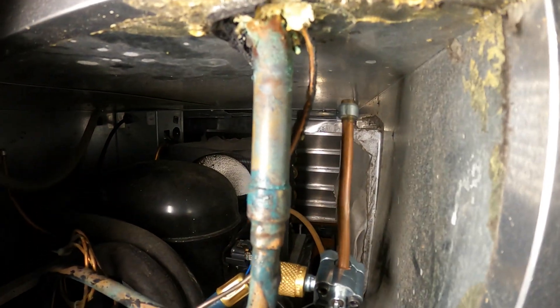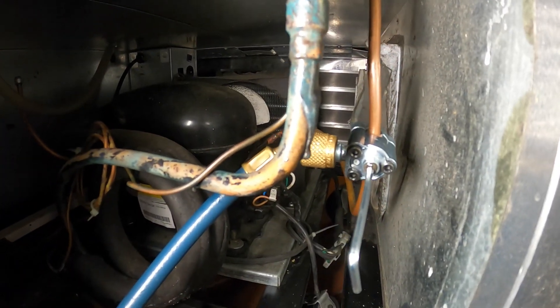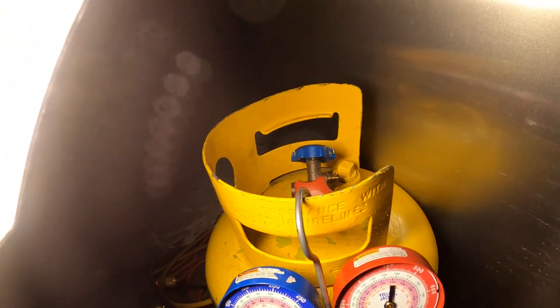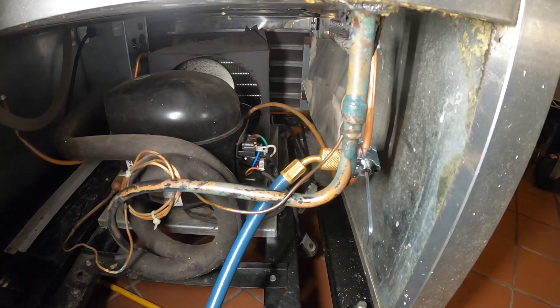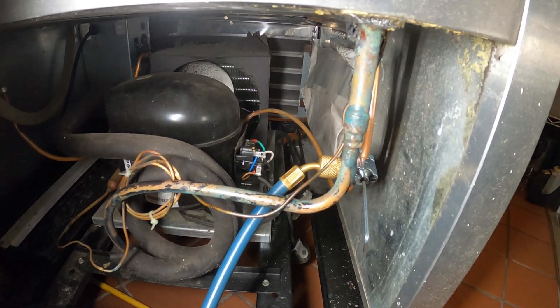This was a self-contained unit where we couldn't actually read any pressure, so that's why I had to install the piercing valve. I have it open right now and this thing is completely empty — no need for a recovery. I must have caught it right when it happened, when it leaked out. I don't know how that happened, but by the time we came back, which was a short period of time, all the gas is gone.